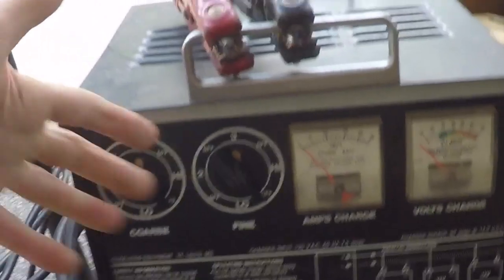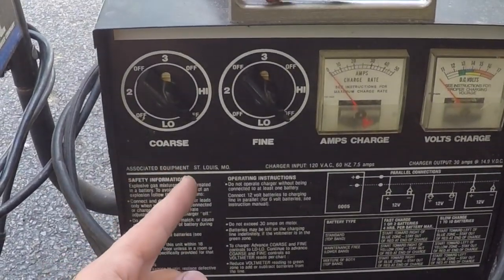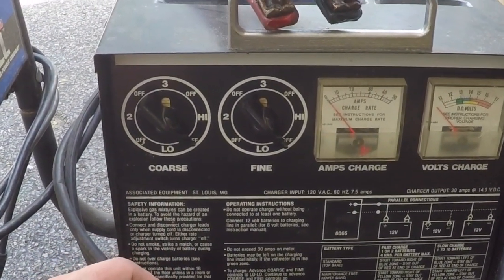We were there yesterday, and the problem we found was the person who used it last didn't put the shutoff. There's a little shutoff for the battery so that nothing's drawing current when it's just sitting there. And the batteries were completely dead. And we put this on each battery for about 45 minutes because we were down there for about an hour and a half just doing small odds and ends. And it just wouldn't, it like clicked when you turn the key. So it was absolutely nothing.